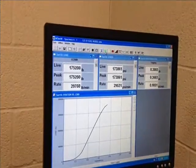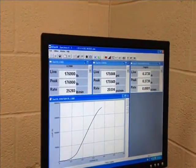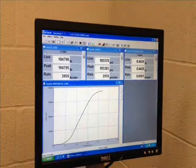The curve is starting to turn and the yield stress has been met. Deformation is now permanent as the bolt cannot come back to its original shape. This area of the curve is called the yielding and strain hardening sections.